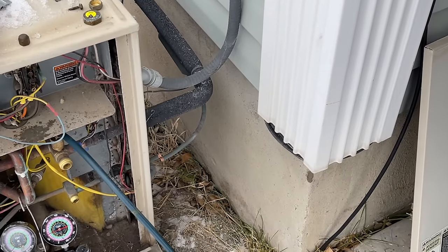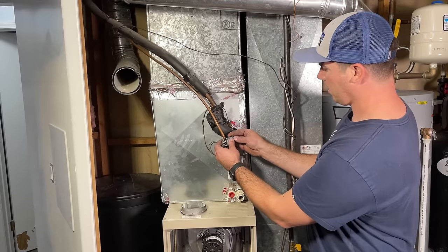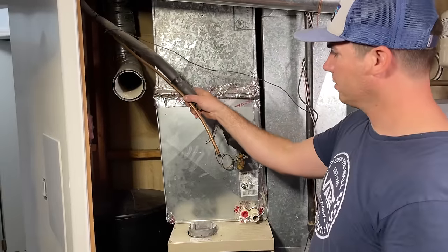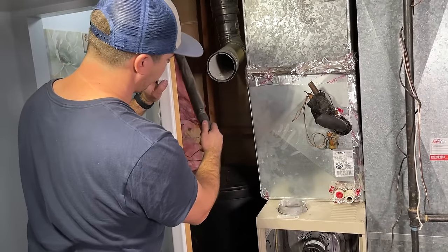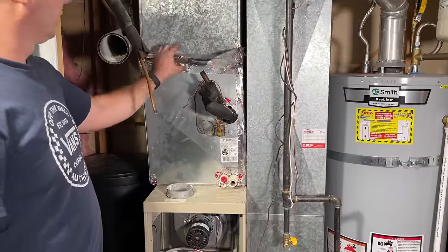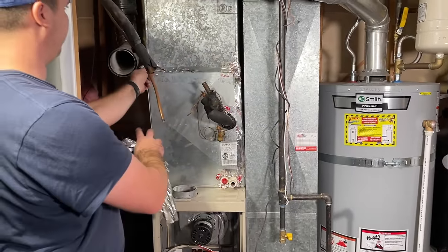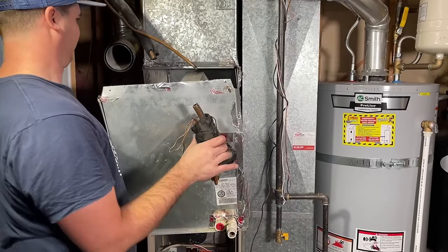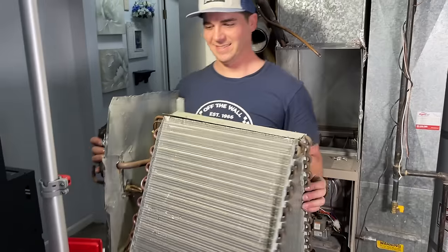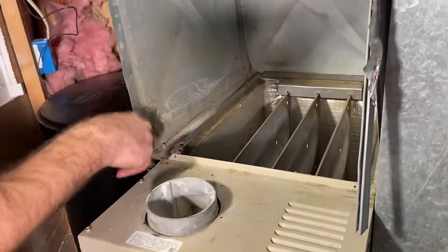Since we have our venting and condensate drain done, we're going to go ahead and cut our refrigerant lines. Our lines are cut — we'll pull this wire from our condenser and move it aside. Next, we're going to disassemble this box that they made and get all of this sheet metal removed and our old coil taken out. We got our coil removed, and as you can see inside here there are zip screws from the inside. We're going to take all these zip screws out and remove all of this ductwork up to this point.